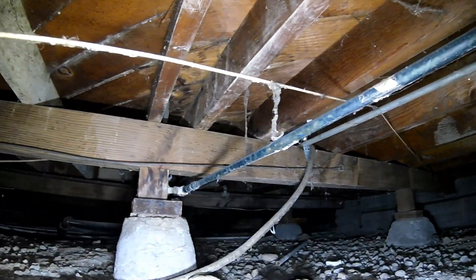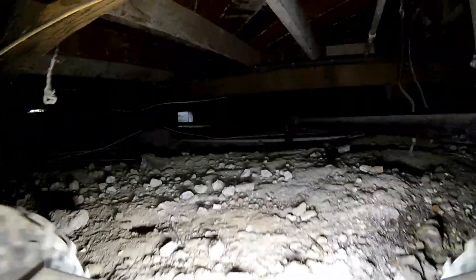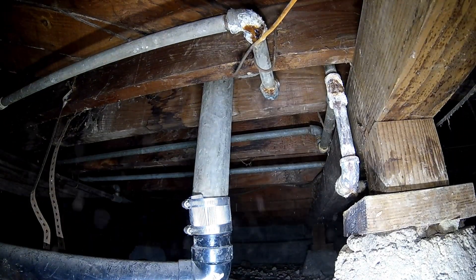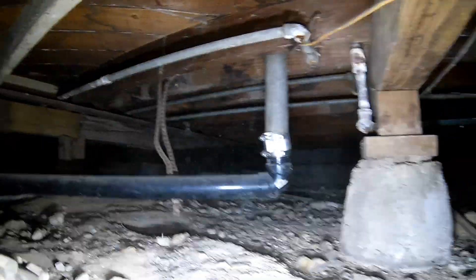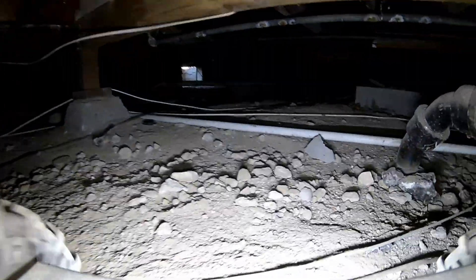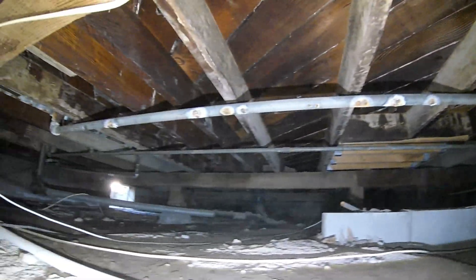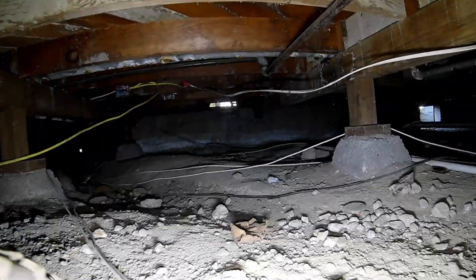See more black pipe — look at that. That's a good 10 feet of pipe right there on both sides. Got to replace that. And there's more corroded galvanized steel water supply pipe right there — two sections, all corroded. Those are little leaks waiting to happen. It's only a matter of months before that stuff starts really leaking and spraying everywhere. If you look straight ahead, look at all those rust marks — those are all potential pinhole leaks or slow drips from the pipe.